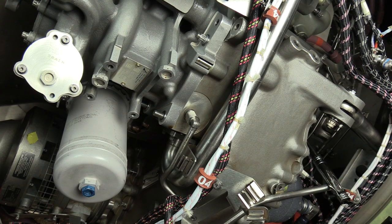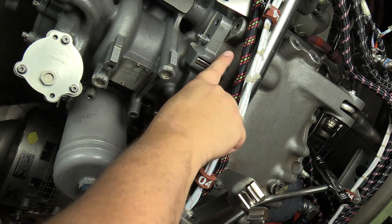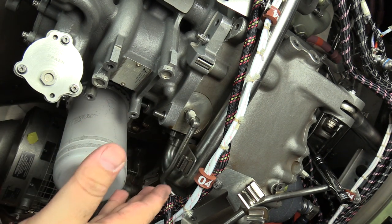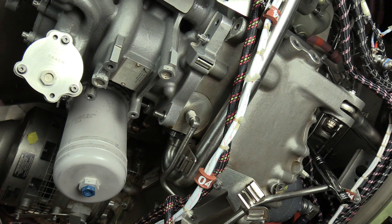Okay, after tightening down the nuts in that alternating sequence, you can see we are fully seated now. What that has allowed us to do is prevent damage to the spline shaft on the main fuel pump, as well as the transfer tube assemblies and the drive pad. So being slow and methodical during this process can really alleviate the headaches of, you know, damaging components during install.